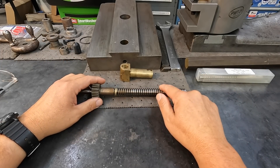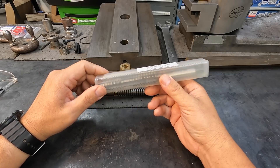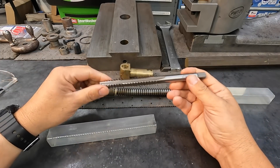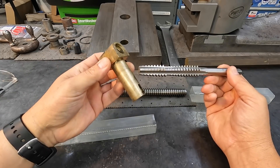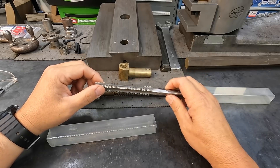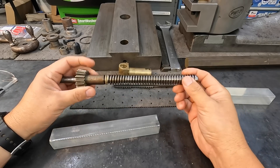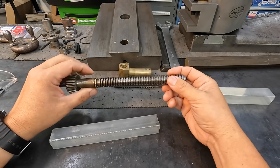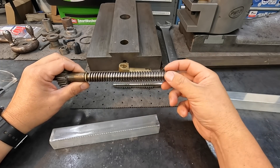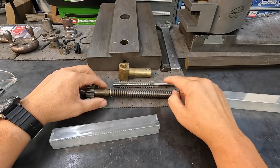What I've done is bought a tap — a three-quarter five Acme tap from McMaster-Carr — and we're going to use it when we go to machine our lead screw nut. But I also want to use it beforehand to make a test nut that we can use as a gauge when we're machining our lead screw. So whenever I'm set up in the lathe cutting the Acme thread, I'll have a nut machined with that tap to match the thread — we'll be able to check it like a thread gauge. We're going to start by making that test nut first.